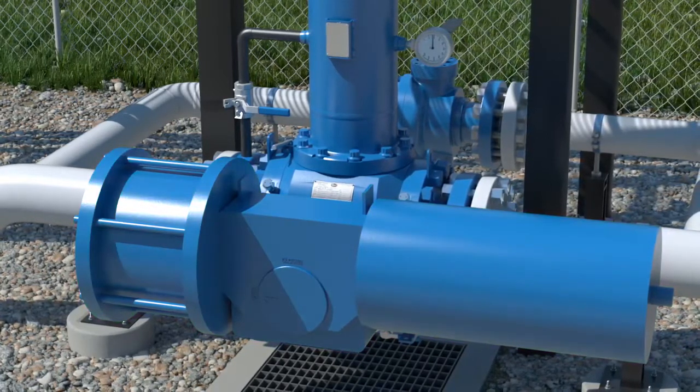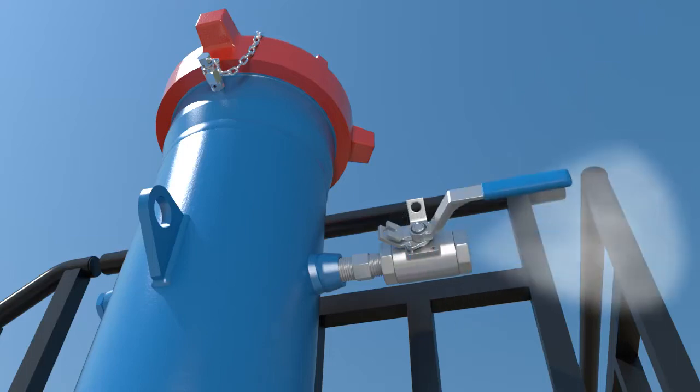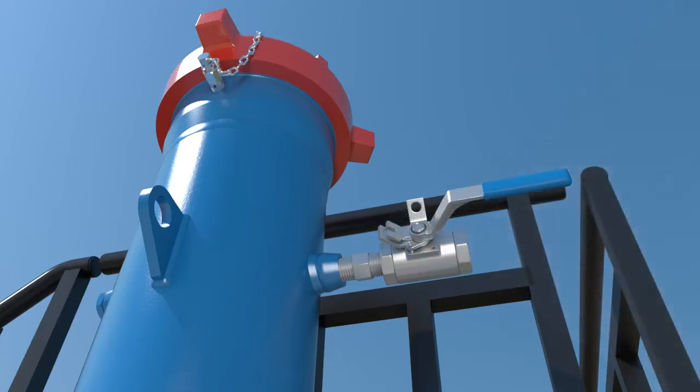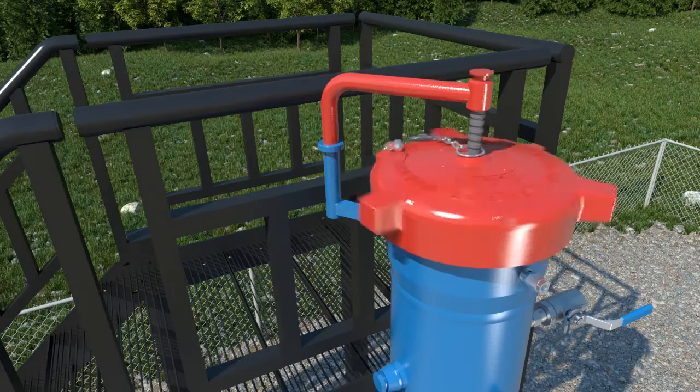To load new pigs into a configuration like this, manually trip the valve and place it in the closed position. Vent the chamber and confirm the seat integrity. You will know the venting is complete through the pressure alert valve on the closure cap.